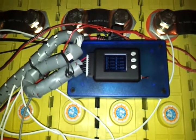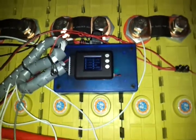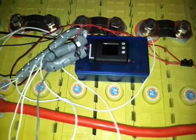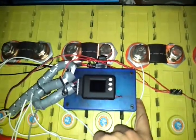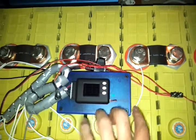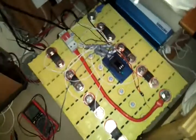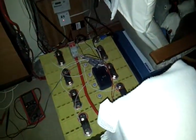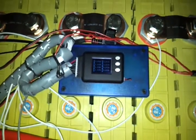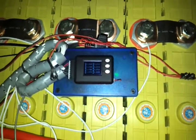I've got another cell just trying to decide whether it wants to go low as well. And you can see the light has gone off. If I try and reset it — oh, the alarm has stopped — if I try and reset it while the alarm is still on, nothing happens. You have to wait for the alarm to cancel. If I turn the load down, now the alarms have all cancelled, the cells are all above 3.31 volts, and if I press the reset button — there you go — the output comes back on.